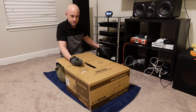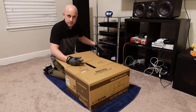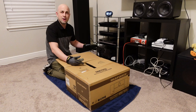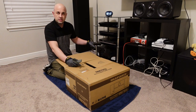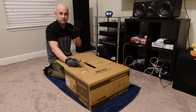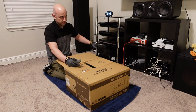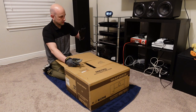The 7013 has 125 watts a channel times 2. When I put this into pure mode playing music and movies with these Definitive 9060 towers — the bipolars — it just sounds amazing. It's loud, it's powerful, and the range between the high and low sounds and explosions is just fantastic. When I put it into 9-channel mode, 5 of the channels are guaranteed with the Marantz 70% guarantee, meaning those 5 channels get a minimum of 70% of the 2-channel rating when running in 5.1.